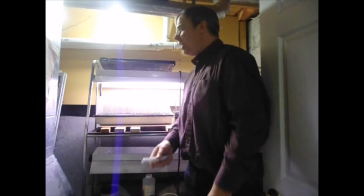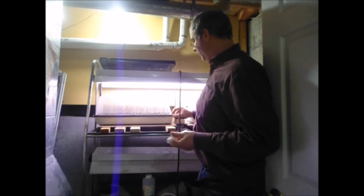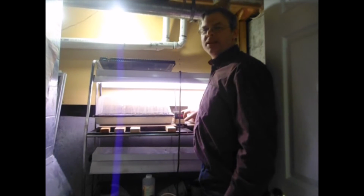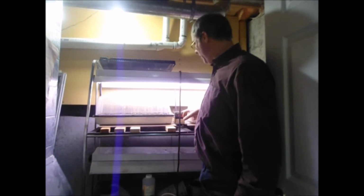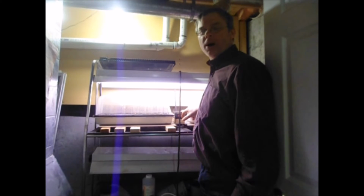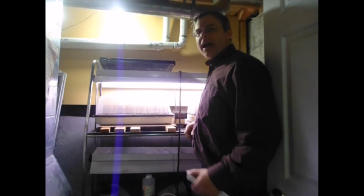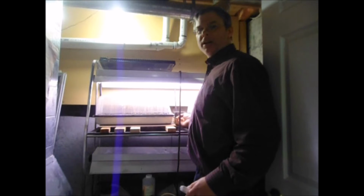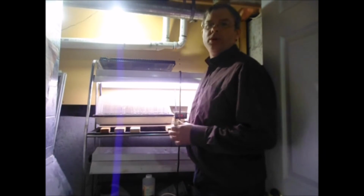So what I've got here in my growing trays, I've got a couple of trays here, and I've got a $10 STC, I think it's the 1000 model, temperature controller. And you can set the temperature on it and have it come out. It's just in a 3D printed box, but you could get or make another box to house it. And it's connected to a cartridge heater in a block of aluminum that sits on an aluminum sheet here. And that sheet runs under these 2 grow trays.